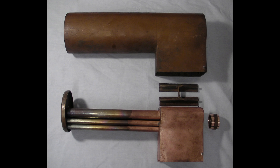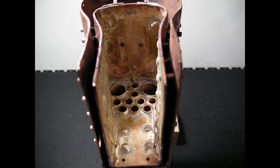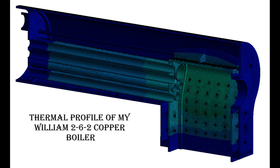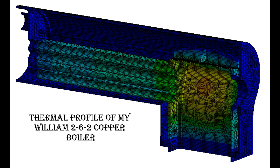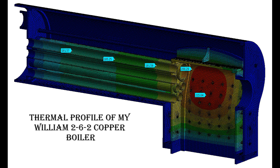Silver brazing is, in my opinion, far more difficult than just TIG welding a boiler. Then with normal use, copper is prone to sediment build up and scaling, which thermally insulates the joints on the cold side causing hot spots and possible failure, which incidentally would not be picked up during the static pressure tests, because it is a compounding thermal failure mechanism. Another issue with copper is the higher thermal conductivity. This is actually counter-intuitive, but convective heat transfer is most efficient just after the onset of nucleate boiling. The minute the bubbles get too large — when the heat transfer surface temperature passes a critical point — you'll have a drop-off in the heat transfer coefficient and the heat flux decreases. Worst case, you get something called steam jacketing, where heat transfer is severely retarded as a direct result of the high copper conductivity.